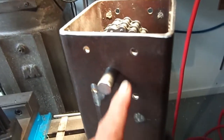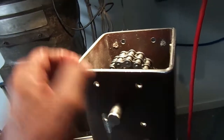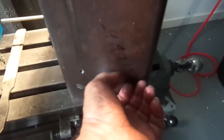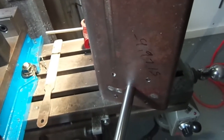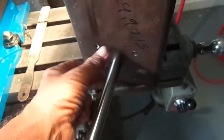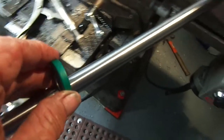The next thing I got to make, I'm making a 3/4 square housing to fit over this. The bolts are gonna come all the way through it. Then there'd be a nut on it. Then there'd be an aluminum square housing that goes here that would have this seal. This seal would be cut inside the aluminum housing. So once the bearing's bolted in there and got nuts on them, then all my piece slides on here.